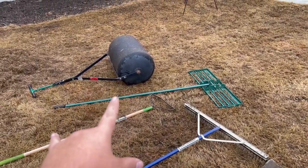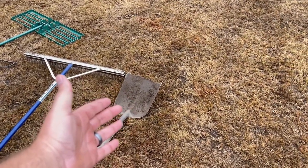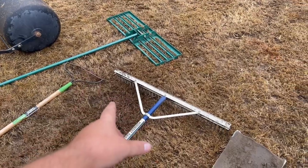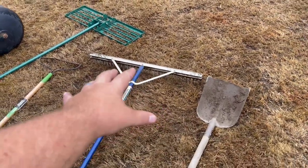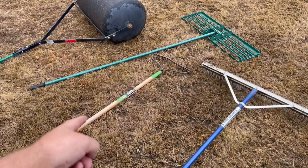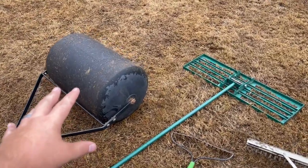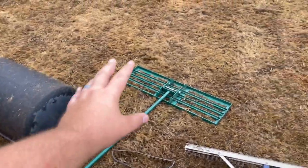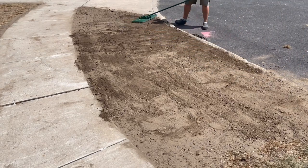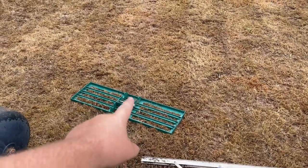Let's go over some of the tools you're going to need to complete this job. Definitely a shovel — you're going to be shoveling some stuff around. I like using a landscaping rake; this nice long landscaping rake does a great job of knocking down piles and starting to level things out. It might not be a bad idea to have a regular smaller rake on hand as well. The first specialty tool is the Lanzy lawn level tool — this thing is going to be great for really leveling and smoothing things out, filling in some of those lower spots and knocking down the higher spots.